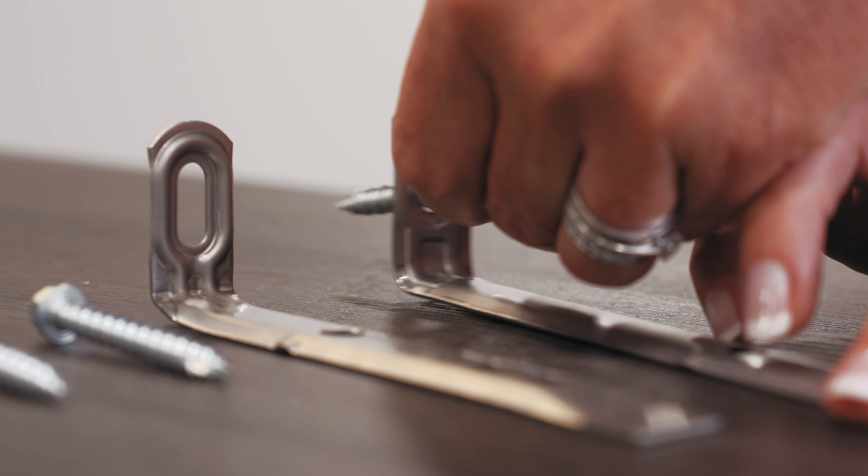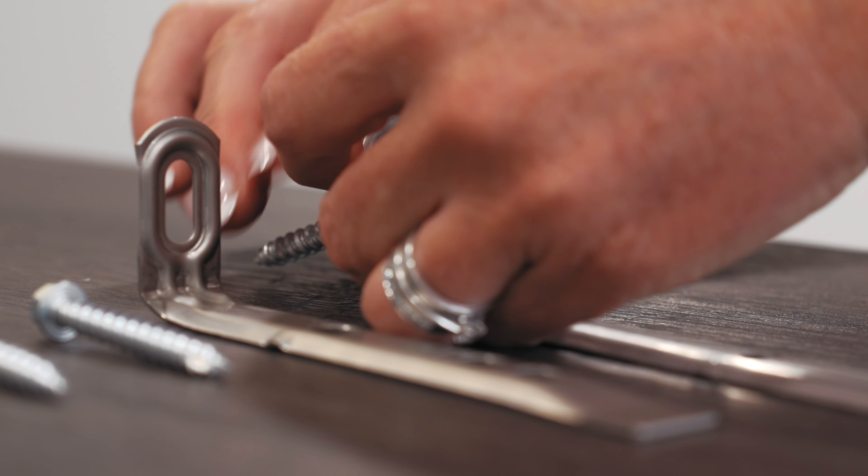Installation is very quick and easy, saving you time and money. Just drill your hole using a 5mm SDS bit, put the fixing through the frame cramp and screw into the concrete using a suitable power tool. It provides a 1kN load when installed into concrete, also giving you peace of mind it has the required performance.